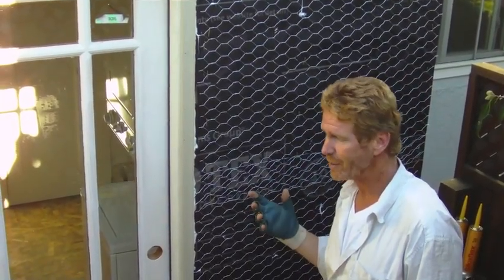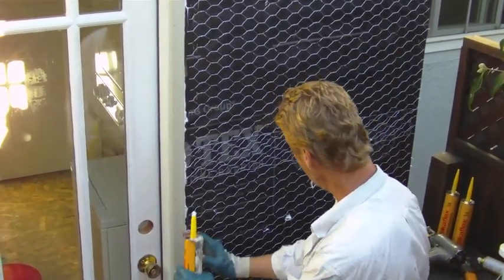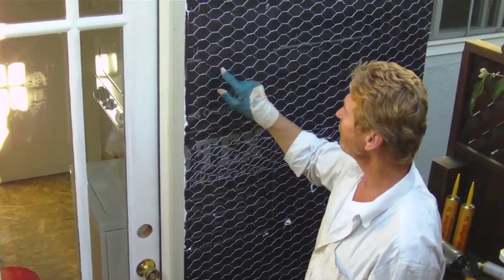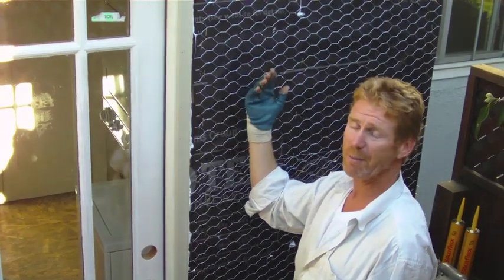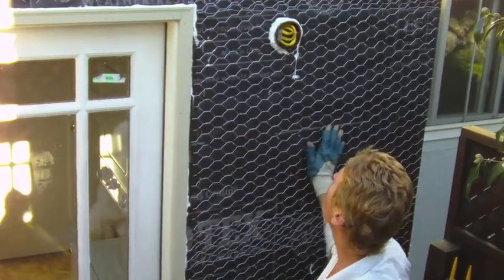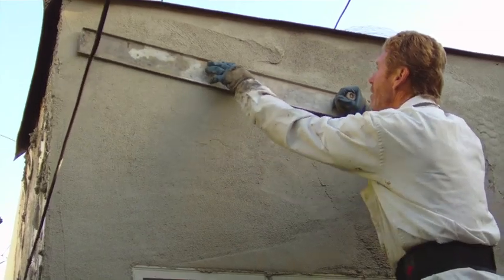A fellow asked me if you can roll the wire out and put it either way. Wire goes on one way — when you roll it out you put it on so it curves this way. This is self-furring wire, which means if you push the paper in, it pulls out about a quarter inch, so it acts somewhat like Dobies do for concrete, lifting the rebar. That's really important.